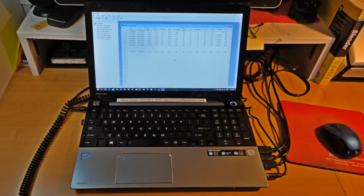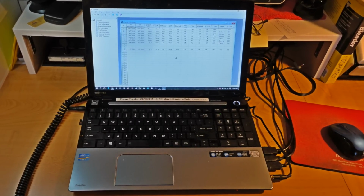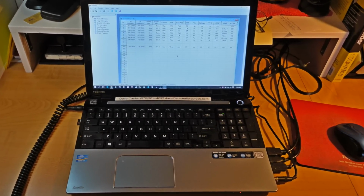And then we're done, right? No. Now, all those settings are also in the frequency mode and are there no matter where you turn the dial. So you must now go back into frequency mode and undo all those changes so that frequency mode is back to simplex. Needless to say, using a computer to program the radio is far easier, but you don't always have your computer available when you need one.